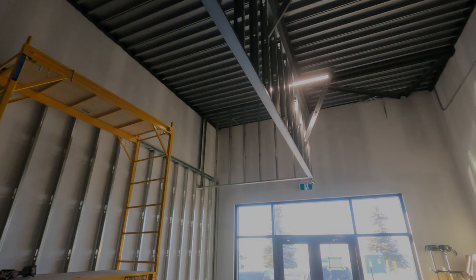It's the same thing as a corner — we're overlapping our tracks on the bottom 100% for sure. At the top, you can see the ribs in the Q-deck. We're putting clips in between the flutes — they're gonna overlap the flute. We screw the clip into the flute, and then the track we screw into the clip. We're putting clips every 16 inches. But if you're lucky enough to land on the flute, you can screw it directly to the flute and you don't need clips. You can also see the clip between the studs on the bottom — that's for this stud. You're gonna screw it into the top track and this clip, so you've got two places it's secure on the bottom and then it's screwed in at the top.